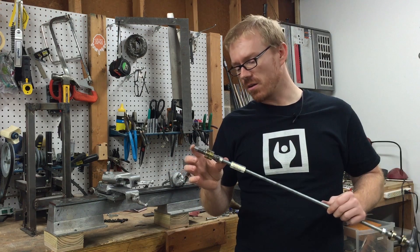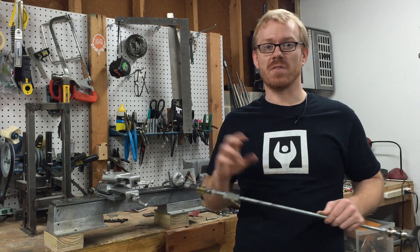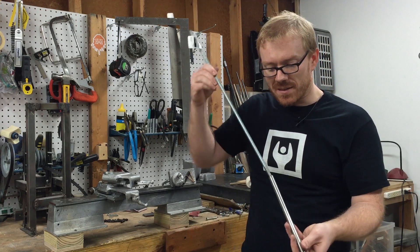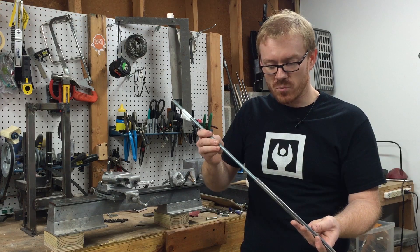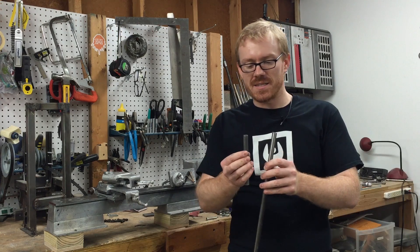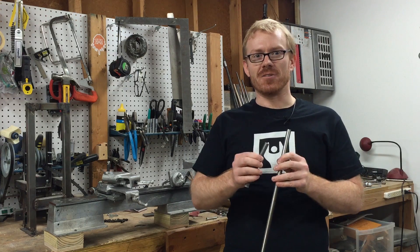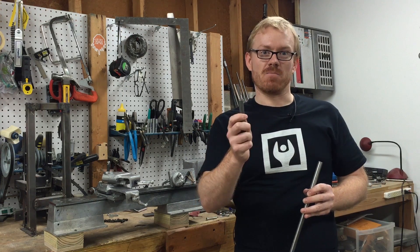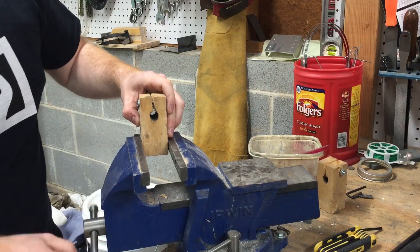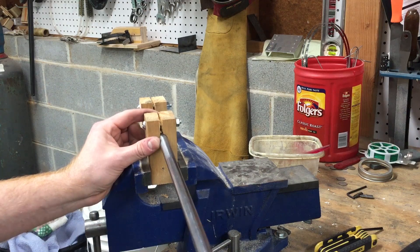The lead screw journals were a little hard to fabricate. The book was written back in the 80s when different materials were available at the hardware store. What I decided to go with was a steel tube — it turns out that's actually a pretty good fit between the threaded rod and the inner diameter of the tube. However, I realized that the tube was actually spot-on half an inch, so 500 thousandths. The rod that I used to cast my bearings is slightly undersized — enough of a difference that I really had to scratch my head as far as the best way to make the journals for the lead screw.